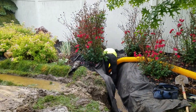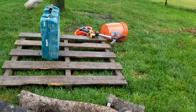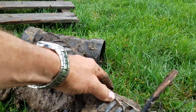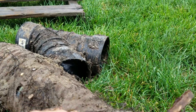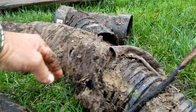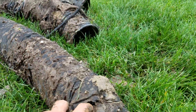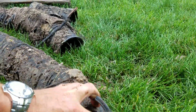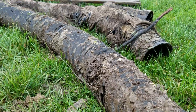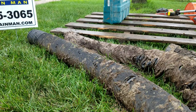Being a yard drainage contractor isn't sexy, it ain't glamorous — yeah, it's muddy and sometimes it's not pretty. Here are two different pipes from two different attempts at this. Here's that polyester soil separator on a three-slot staggered pipe — one was originally white, this one is black. We found both failed systems. This one has some dirt in it too, but you couldn't get the water into the pipe because they didn't wrap the trench and separate the soil from the drainage stone.